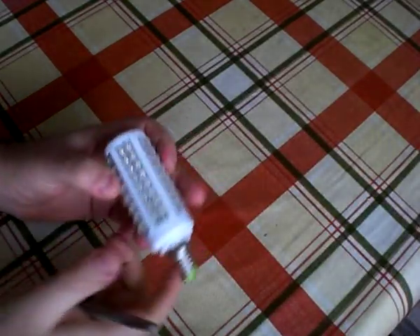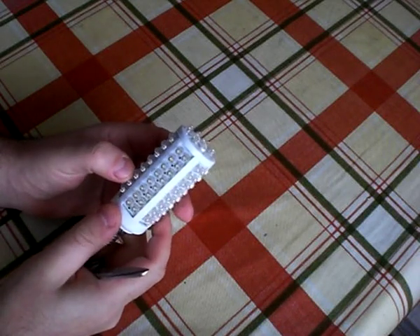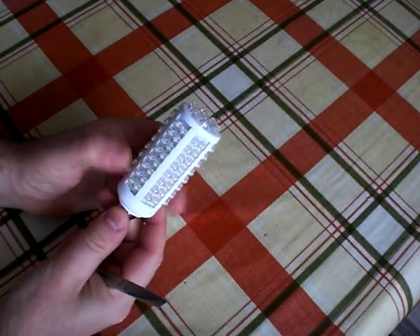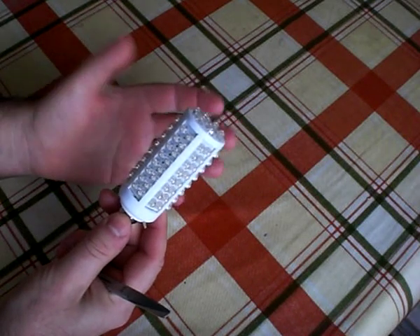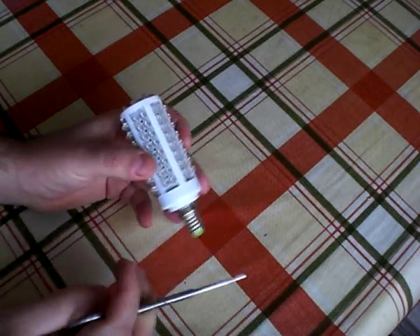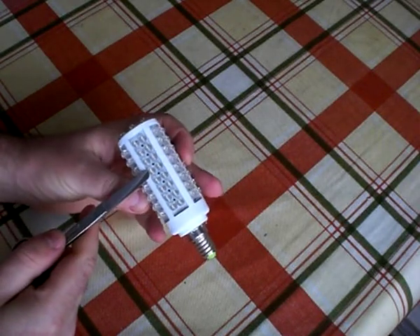That's what the light was like and I actually couldn't get on with it. I found it was too harsh to look at. After about a week of use, the light output dimmed down to half of what it was originally. It was a weird greenish-yellow light that just didn't illuminate the room properly. The lights themselves looked really bright in the fitting, but when you looked at an object that was red or green, it just wasn't being lit properly. I suspect it's because these LEDs have a couple of very narrow spectral peaks — producing a lot of very blue light and a lot of very yellow light — which to our eyes looks white, but when you shine it on something green or red it's just absorbed. I'm not going to keep these.